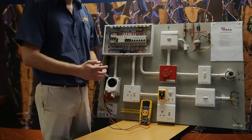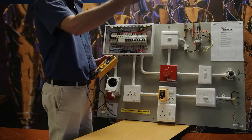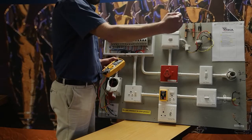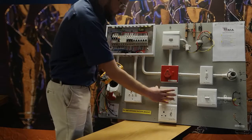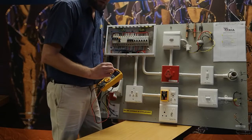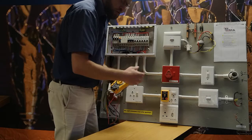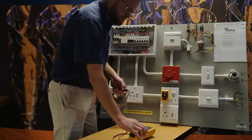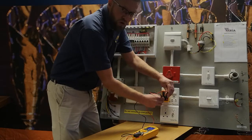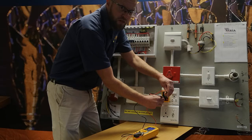The next test is your worst-case voltage, or volt drop as they call it. Where you measure that is normally your furthest point of consumption, whether it's a plug, a double plug, a light switch, or whatever. You go to that furthest point of consumption and put a load onto that point, which must be more than 50% of the circuit value and not less than 2 amps. If you put that load onto that circuit exceeding that consumption of more than 50% or 2 amps, you'll take your multimeter, put it on voltage, and measure your voltage. It can't be more than a 5% difference — or 5% volt drop as they call it.